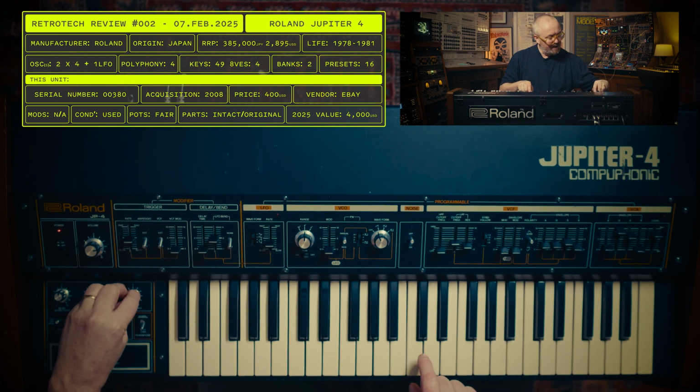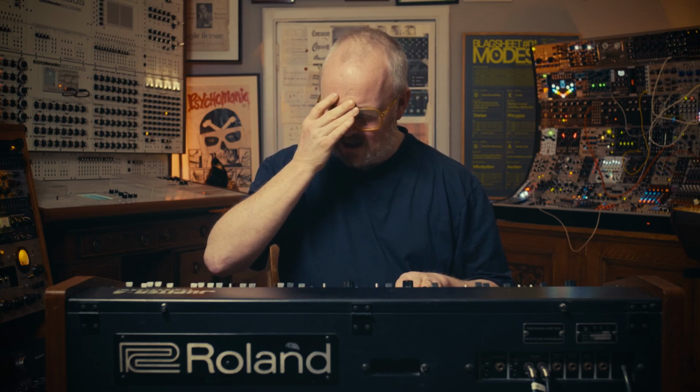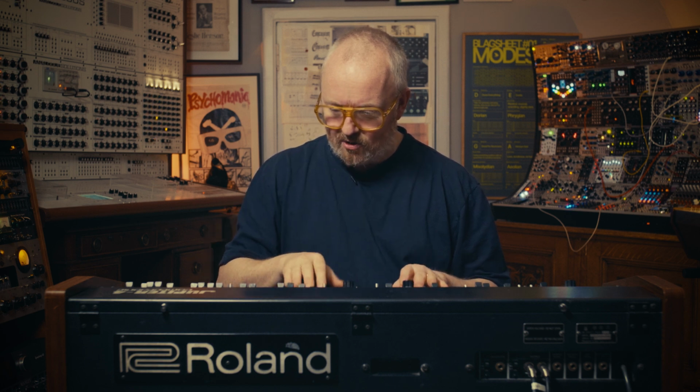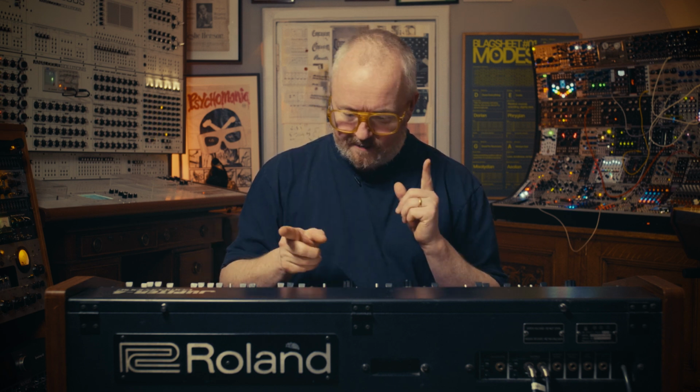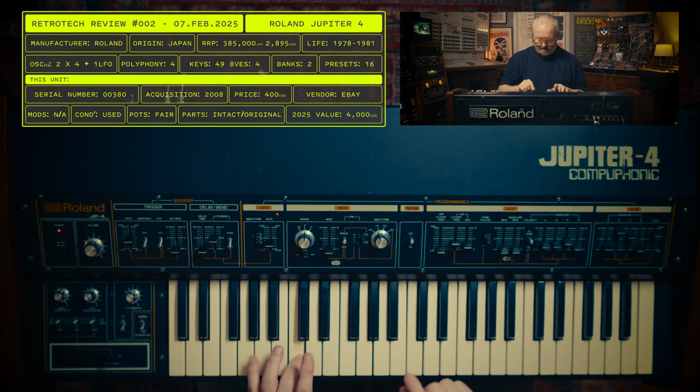And finally, we have portamento. Basically means the voltage shifts gradually between the differentiation between notes, so less note voltage. So switch that on, make it nice and slow. So it must be oscillator dependent. So when it thinks you're using the same oscillator and there's a difference in voltage demanded, it graduates that voltage.